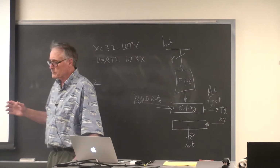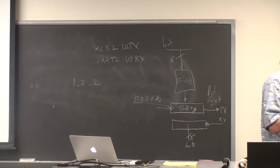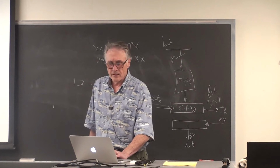But there was a better way to do it, which I then implemented, which was DMA put serial buffer, which starts a transfer to the serial buffer and then just yields until the whole string is transmitted, because the DMA is smart enough to stop a transfer on a character match value, and the end of a string in C is always hexadecimal zero. So the DMA stops when it reaches the end of the string, and then signals that the thread can execute again.